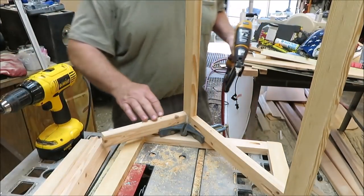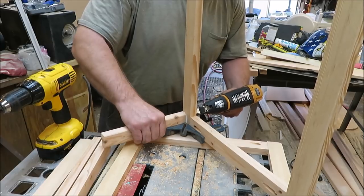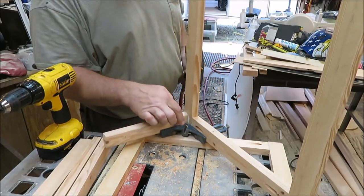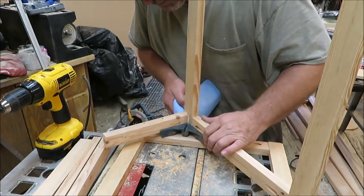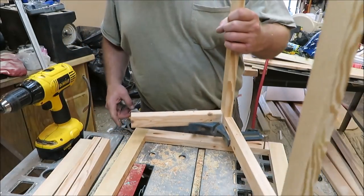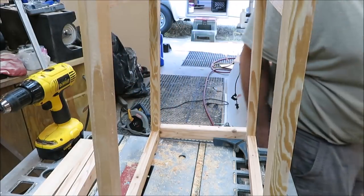We got both of our sides done and cut some little short ones in here - I think these are about nine and three-quarters of an inch. I got some pretty long brads, put some liquid nail - you can see it kind of squishing out there. This just basically hopefully holds it together until the glue sets up real good. These little clamps are nice for this type of stuff because it holds it in place until you get done getting it nailed where you want it, then you can just wipe your glue off. Hopefully we end up with 11 inches on this thing - that's the goal. It's got to be 11 inches wide overall - it's going to be a tiny little cabinet but every bit of storage we can get, we're going to need it.